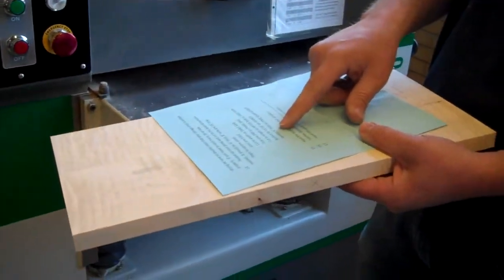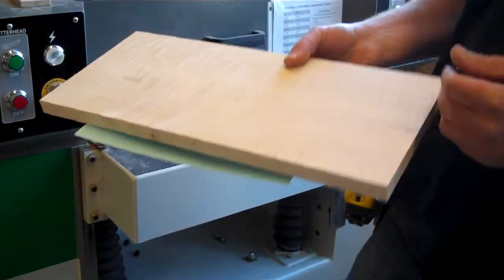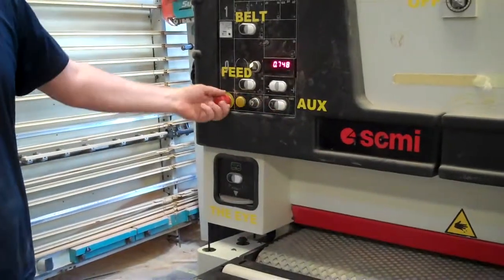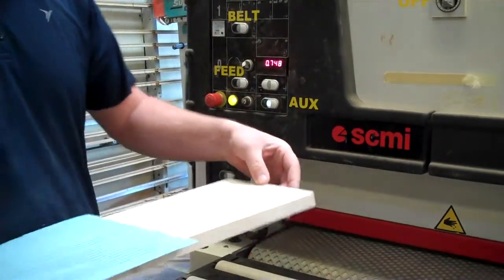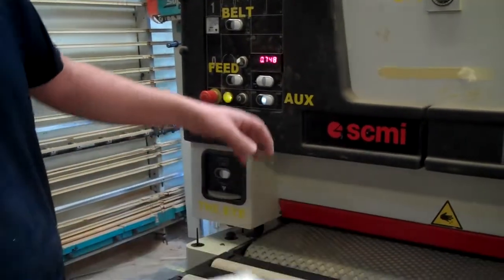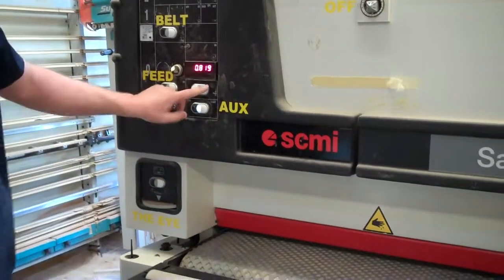Last, it says sand down to 3/4 on the time saver sander. So again, we've just got it at close. Now we're going to final sand it on the time saver sander. Last step, come on over. Just a reminder on our time saver sander, you're starting at whatever it was thickness-wise, and we're going to go down to 3/4. So I had planed it down to 13/16, so that's where I'm going to start. 13/16, 0.812. So let's get this at 0.812.